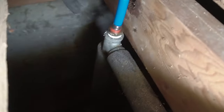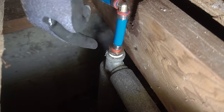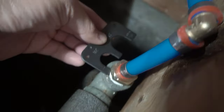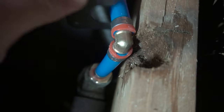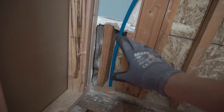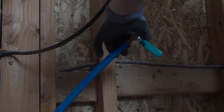Friends, we got the transition fitting right there from three-quarter inch to half-inch PEX. We got it all connected — elbows right there all the way up. Using the gauge right here, if it fits like so, that's good. I'm not going to cut this yet — that's for a different video. This is going to be a brand new spigot out there, which I'll show in a different video. I've attached a shut-off valve at the end so I can close it.